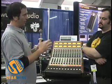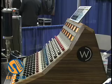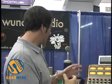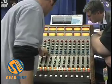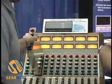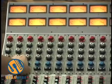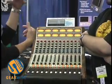About five or six years ago, I loved those modules so much I wanted to put them in my Neve — a big 48-channel 80-series Neve. But they wouldn't fit; they were a little too wide. So we re-engineered the module from the ground up, reverse-engineered it to fit into the 1073-style enclosure. The rear connector is an Amphenol 18-pin connector, which is compatible with the 1073, and it ran on the same 24-volt rail. But that's where the similarity to the 1073 stops — just the size and the rear connector.